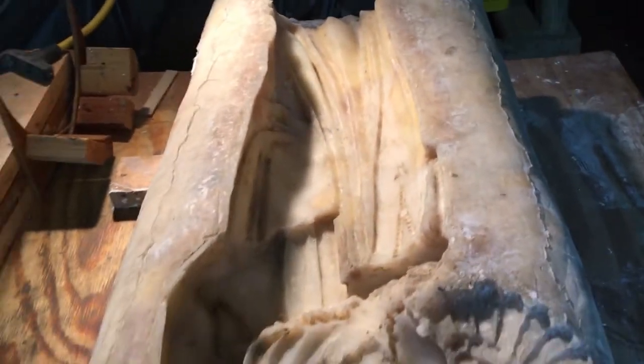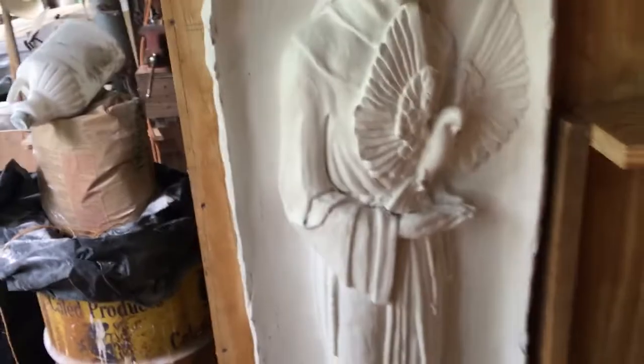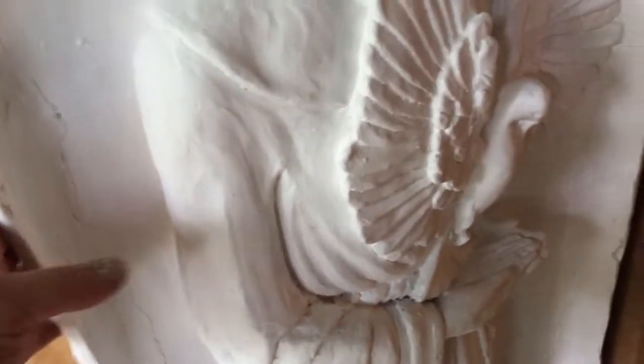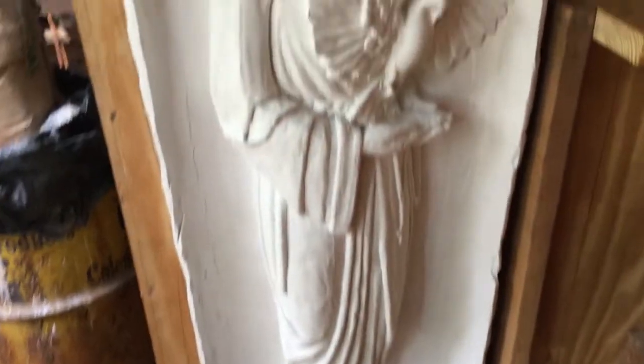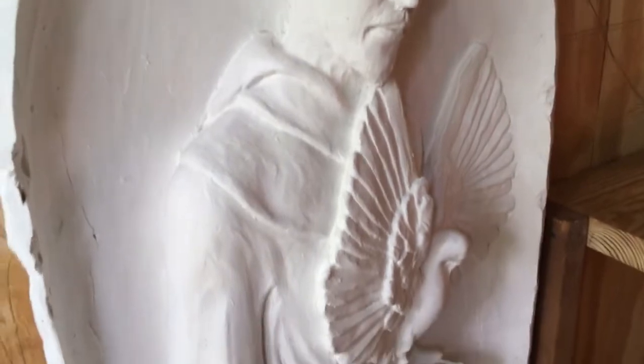Because we constructed the model from the back, we were able to take out just a handful of screws around the perimeter of the niche and a few pieces in the middle that were helping retain the clay to the wood, and it just popped right off. We were able to evacuate the clay, clean the mold up, release it again for the plaster, and then pour a positive. This is fairly close to where the rubber is — it might be a little short. Had one loss on the corner where I didn't put quite as thick, but I wanted to make sure the sides were good. Got it all done and gessoed up. The gesso's nice to seal — brings out the white, really cleans it up. It'll seal it, keep it from having issues with dirt or mold. I've got some models that were gessoed over 15 years ago and they still look great.